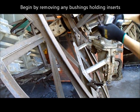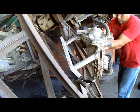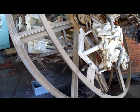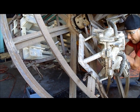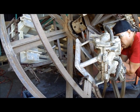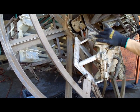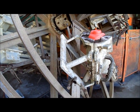He's beginning to move the first piece of the mould. This is a three-piece mould — all rotational moulds tend to be two or more pieces. They're almost complete removing all the bushings, and now he's going to pry the first piece of the mould off, exposing the moulded part from the previous cycle.